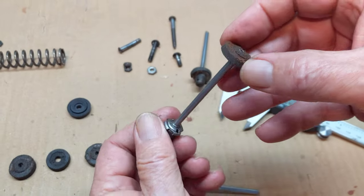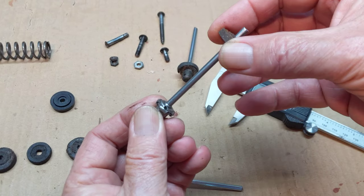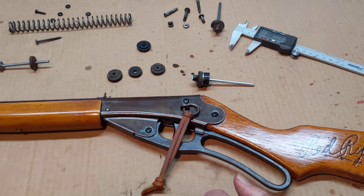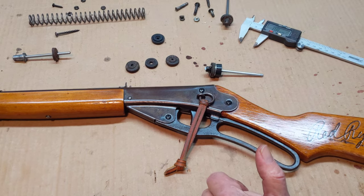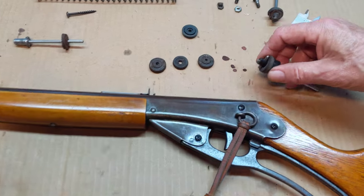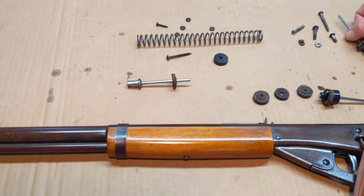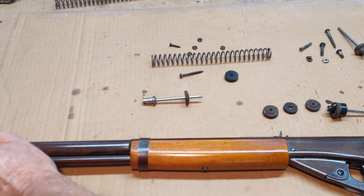In the particular case of this replacement leather seal set, the interior hole was so small that it was dragging the abutment washer back and forth — no compression. Once we got that sussed out, we started swapping in combinations of mainsprings and air tubes to get to a point where the gun would fire and be as original as it possibly could be. We've come to a solution where the gun runs about 250 feet per second with one of these synthetic seals at the base of the abutment washer — that stays put — and then the original top hat air tube with a leather seal on it pushes air through the compression chamber and fires the gun with the original bottle cap.